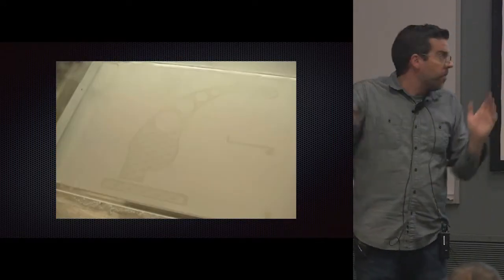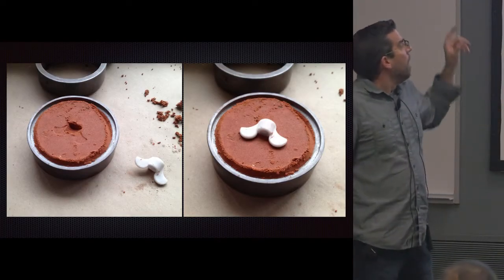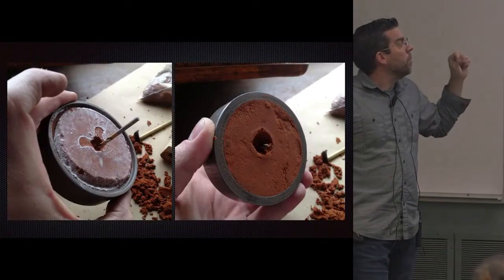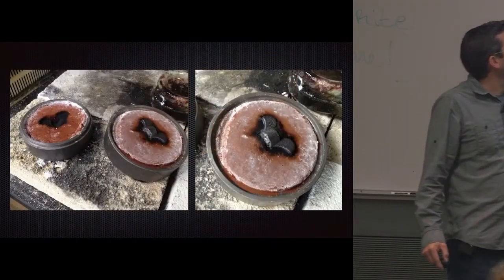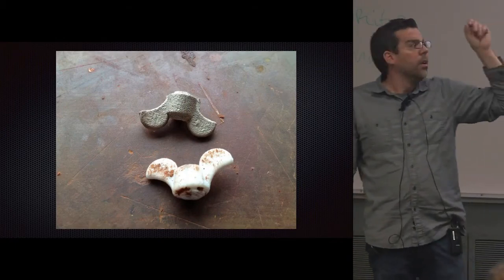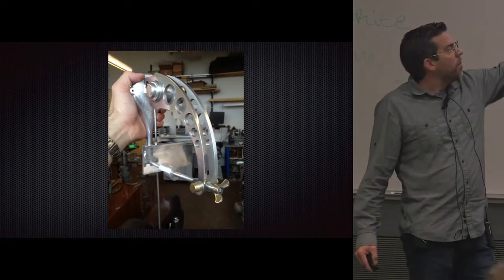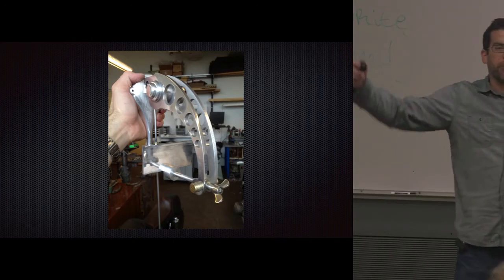I could make it larger if I wanted to, print that part out in about 30, 45 minutes. I make a traditional sand mold around that part, pack it with sand, drill a hole basically for a sprue, create my button, put it back together, align it, heat my metal up, pour it in, voila, part, metal part, functional part, okay? Probably within about an hour and a half, okay? Pretty quick, quite a bit faster than lost wax. So I'm able to then make this part that I want from a catalog download that I've altered, printed, and made in real material, okay?